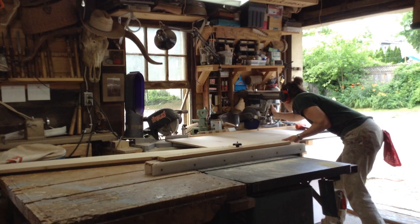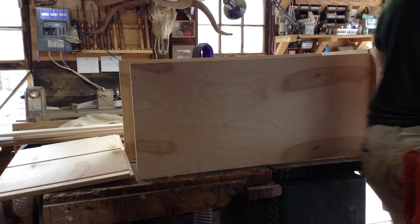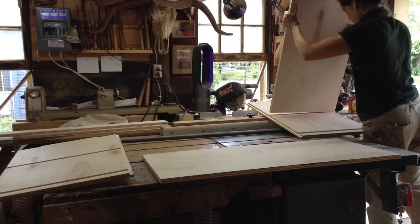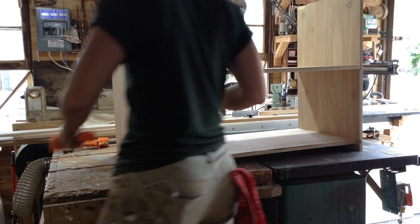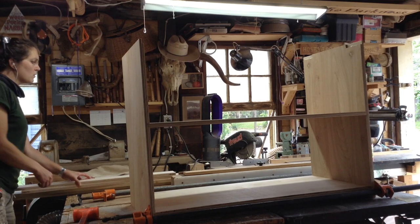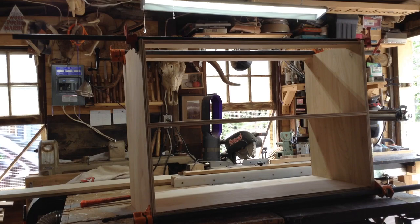This is just rough cutting the backer board. I usually put these on all at the same time, but here I used it to hold everything in place because I had to use pipe clamps to glue this — it's so wide I couldn't put the backer on since it was elevated off my table. I put glue in all of the joints and glued it together. A lot of times I'll use screws on the edge of the panels, especially for built-ins where you'll never see them. But since the whole point of this three-piece design is so the pieces can be used separately one day, I wanted the side panels to be clean without screws in the sides. So I'm using these long pipe clamps, elevated off the ground. I put the backer in place because it helps square the entire cabinet while it's drying.